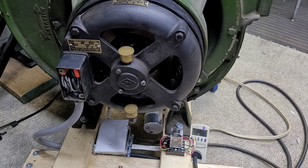So I stopped it and said, well what the heck — like how would it reverse the direction without switching the leads around? It's a three phase motor; it should go the same direction it was going before. So I tried it going straight to delta from a dead stop, and it actually went the correct direction. So I figured maybe something was wrong with the relay, and I took the relay out and swapped it with the relay out of the B-25, popped that in, and it worked fine.